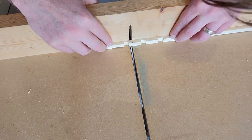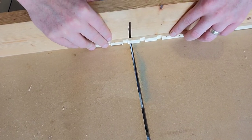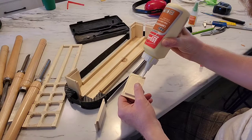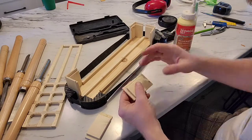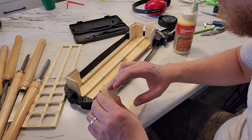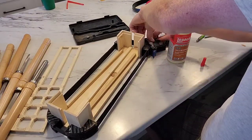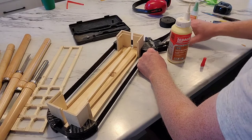I found myself in more trouble when I found the chisels didn't actually fit into the holes I had made. I needed to notch them out by about one to two millimeters more on each side, just so I'd still get a snug fit without being too tight. On the left you can see kind of a pattern the way those things go together — I actually ended up really liking how it looked. We'll call that a happy accident. Here I'm gluing up the sides; the whole thing will stick together with glue, and I'll put in the top pieces to support them as well.